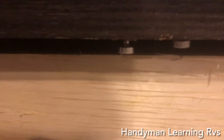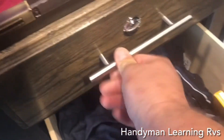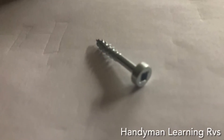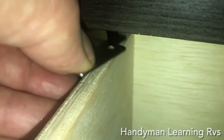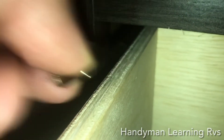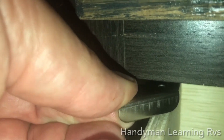That is perfect. Now I'm going to bring the other one down to be the same height — pull them out and they're both the exact same height. Now with those being the exact same height, I'm going to shut the drawer with the latch out and it should hit. Press the button — it's nice and secure. The best thing about using screws is you don't have to worry about the gap and putting spacers. If the gap between the door edge and the drawer opening is too big, you would have to put spacers between the bracket and the drawer opening for the latch to catch.